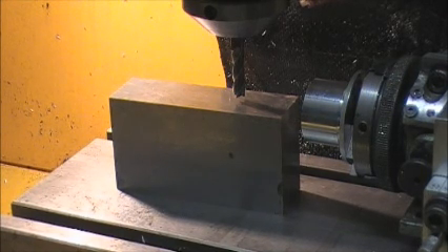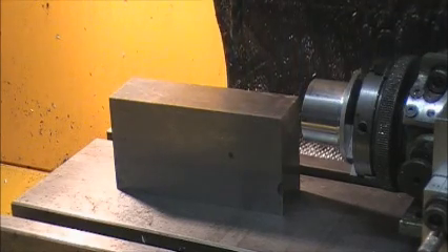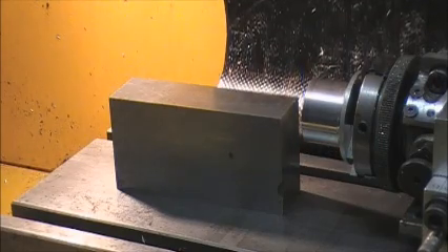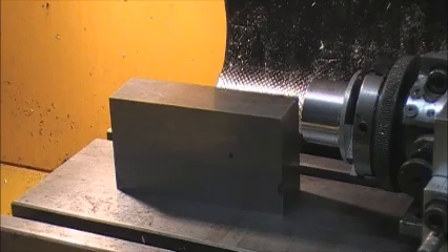I hope that's clear. It's important to get the sign right — we obviously don't enter a positive reading, it's important to enter the negative on the tool change function, otherwise you'll have a problem.